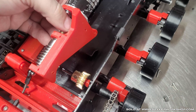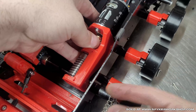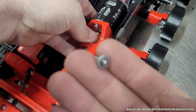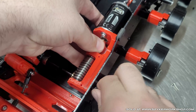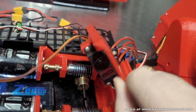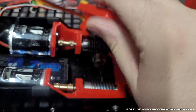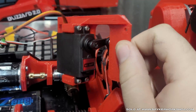Using three screws we're going to connect it to the wall here. The screw that's right here — the front one — make sure to put a washer on it, otherwise it gets a little too close to the worm gear. I recommend using some kind of thick grease; I'm just going to use some marine grease I have on hand. This piece will be screwed on here, and then you can set up the servo just like shown here — it's just those four screws.